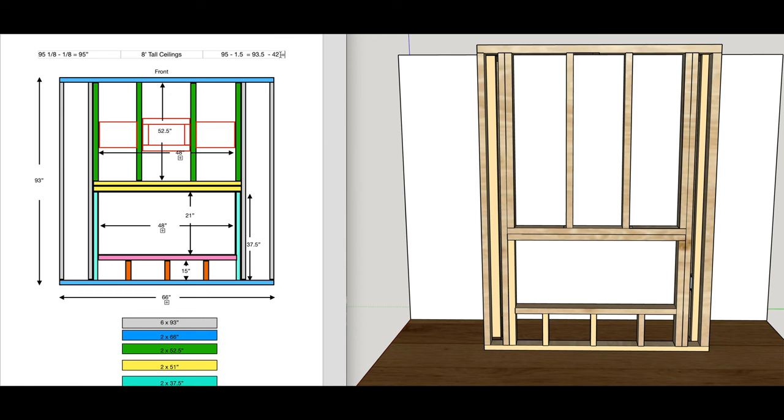Make sure your walls follow the outline you drew on the ground, with the front wall parallel to the back wall. Place walls one at a time, use a long level to ensure they're plumb in both directions, and attach them into structural members of the house — floor joists, ceiling joists, or wall studs — so they won't move. That's how you measure, cut, assemble, and install all the walls for your fireplace. After that, we'll get into how to make it look nice and install the actual fireplace unit to complete the addition.